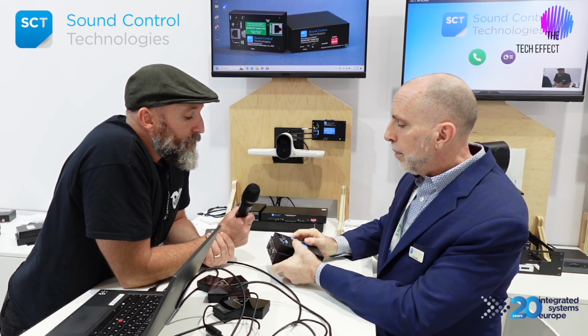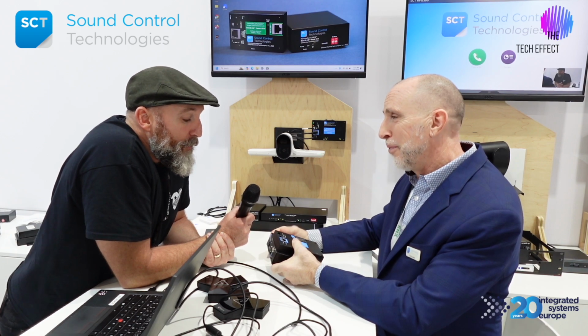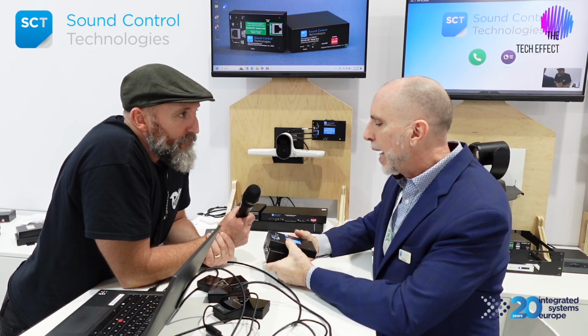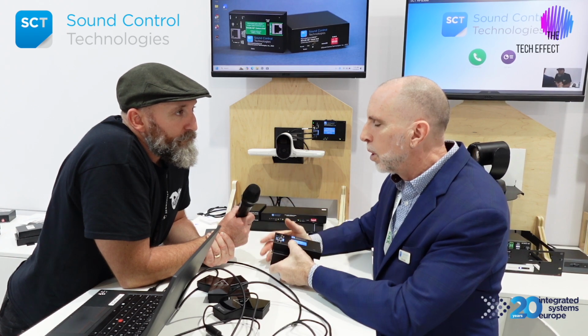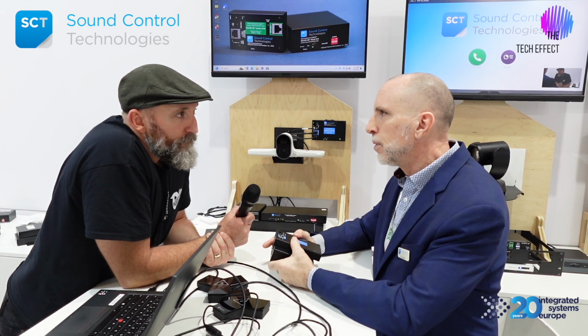And speaking of cat cable, 100 meters of cat cable for a 40 gigabit pipe, there's a catch to this. There's always a caveat, right? The caveat here on our SCT link, and it's not us, it's the technology, requires a Cat6 U/FTP cable, which is insanely stiff. It's hard to pull, it's hard to manage, and it's hard to do solid core. The bend radius is ridiculous. It's really not applicable to what we do.